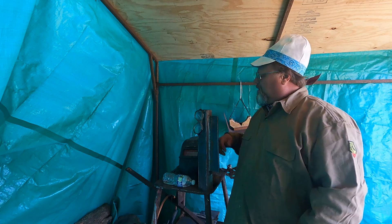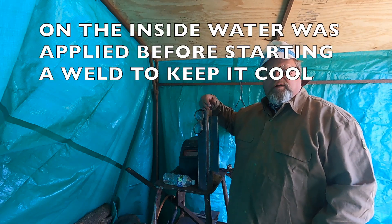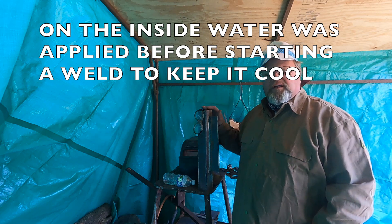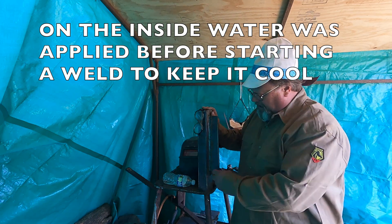You've got to watch your heat. While I welded this I did put water on it, poured it on here and buffed it and cleaned it. You've got to clean all your passes as soon as you stop.